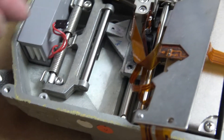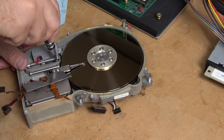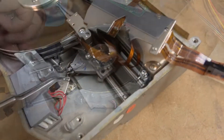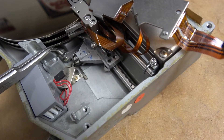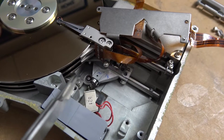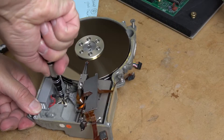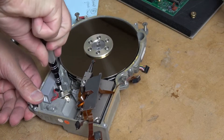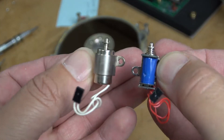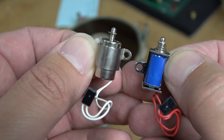Here's the spring, and here's the wire that goes to the solenoid which is down here in the bottom — there's our solenoid right there. Here's our spring, and then this piece right here is the cam that locks the head in place. Once this comes back it's allowed to swing this way and the heads will come down. The two solenoids are slightly different but about the same size — this one has a square cover on it, this one's more round. The distance is the same so it should work.